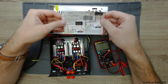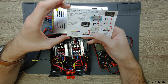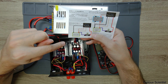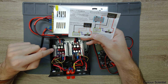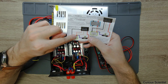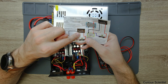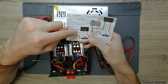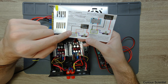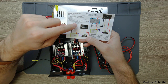What I did here is basically realize two different designs, and there is one small difference between them. On the left hand side, the positive side connects to this green component which is the DC-DC converter — not shown in the original drawing. The voltage and power supply rails, VCC and VIN, which you can check on the back panel of these power meters, are connected to the same thing: the positive output for the load.